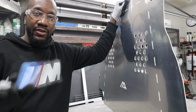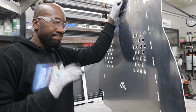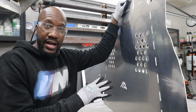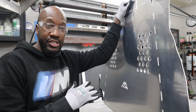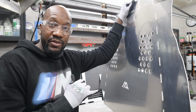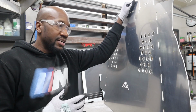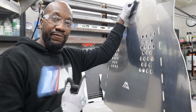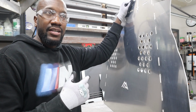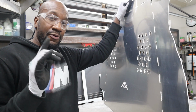So if any of you guys out there watching this video could maybe give me a pointer on how to get no slag, that would be awesome. This isn't horrible slag, but if I were to kick these out in production, and let's just say I had 25 orders, this would get tiresome very, very quick. All right, so any guys out there, please fill me in with your knowledge. I had the plasma cutter at 45 amps, and I also had the feed rate at 80. The speed was 80. So yeah, let me know in the comments. I would much appreciate it.